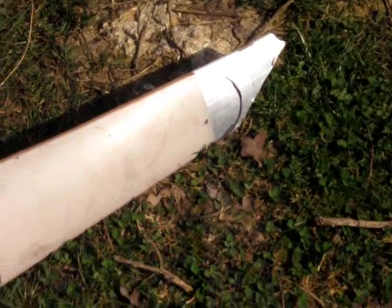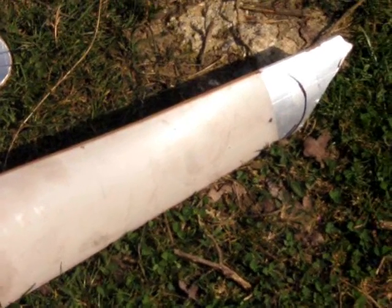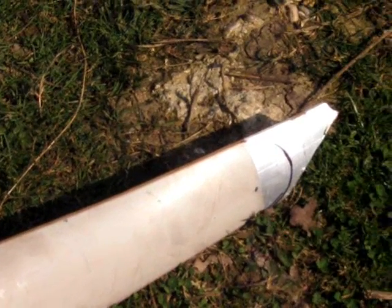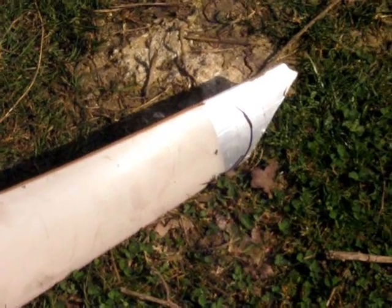I've got some material to find to make up three of these ones here, but I might as well cut them at the same time. I'm going to show you how to actually cut these out — the method I've used, which is very straightforward and simple. The reason for using PVC is it's extremely quick. So if you want three sizes of blade, you mark them out very quickly, cut them, finish them, drill holes in them — job done. You don't have to waste time and effort making blades for your area if you're not sure how they're going to perform; you can do several pretty quickly.